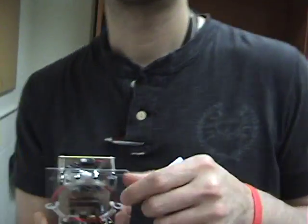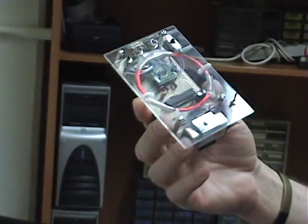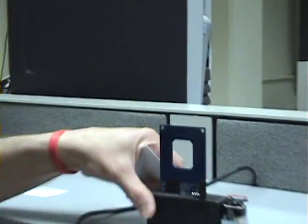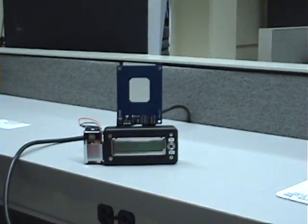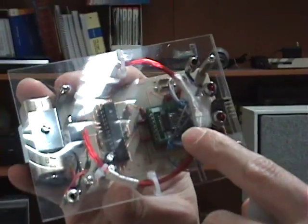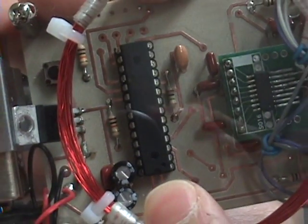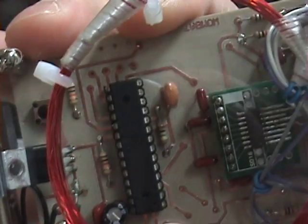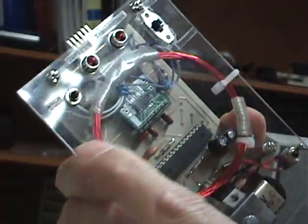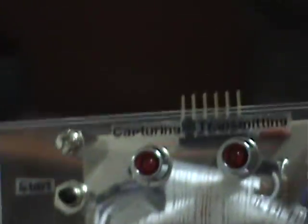This is the culmination of the last year here at the engineering building. This little guy right here incorporates some of the same features as the previous device. What we have here is our 700 micro-Henry coil, which is actually a coil right around this little guy — that's what all this printed circuit board is. We have the same EM4095 RFID 125 kHz front end right in here, and over here is our little microcontroller, which is the ATmega168 from Atmel, also known to hobbyists as the Arduino. 9-volt battery, 5-volt regulator, series of capacitors and networking, on-off switch, and a whole series of LEDs and switches.